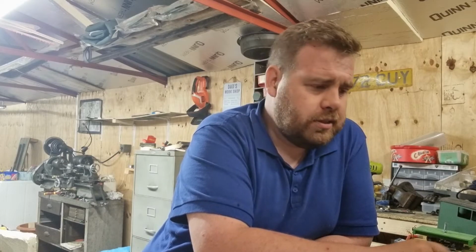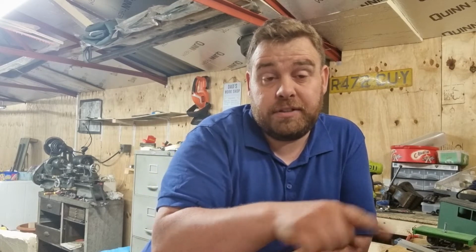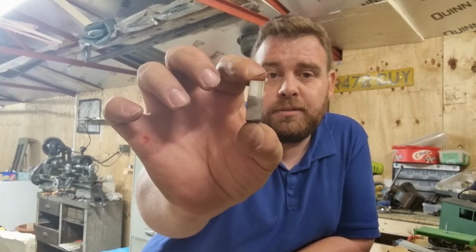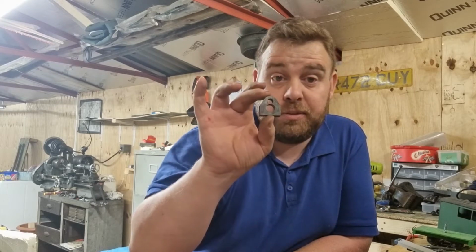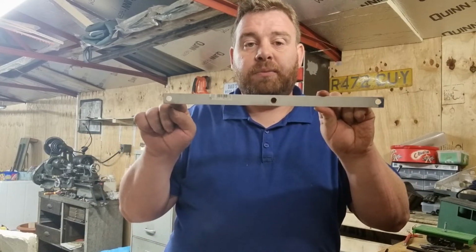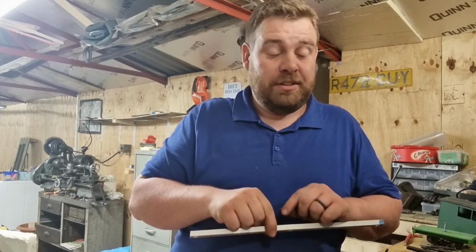I can't remember if I mentioned cranks, but I am going to put cranks on it, so it's got a side rod going round. It doesn't really need it because both axles have a drive on them, which I'll show you in a minute. But I had these made up. If you can see them, they're 10mm mild steel. I went to a local sheet metal company called Locate, which is here in Scunthorpe, and I had 4 of those cut out. The bigger hole goes onto the shafts of the wheels. There's 4 in total. Then I'm going to make something like that. It'll just have one hole there and one hole there, and I think it will look a lot better than just 2 shafts sticking out.